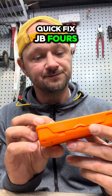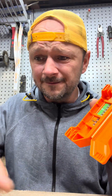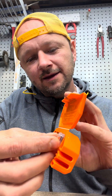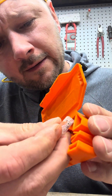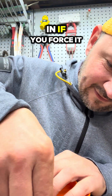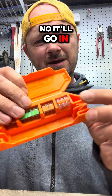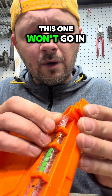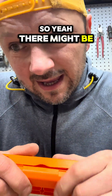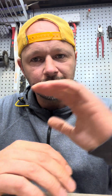What about the Quick-Fix JB4 boxes? These are designed for genuine Wagos, so genuine Wagos fit perfectly. The fake ones unfortunately don't - they're a bit big and just don't fit. You can force one in so far but it won't seat properly. So the Chinese fake Wagos might be half decent connectors, but they don't work too well with other companies' accessories.